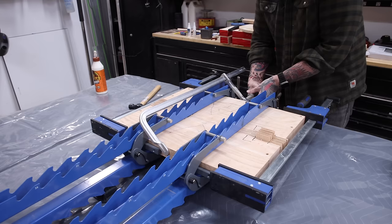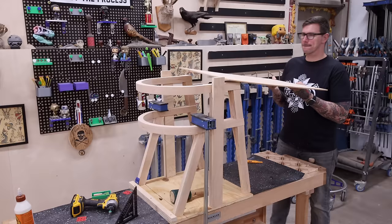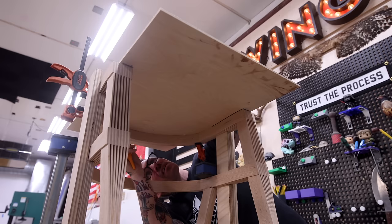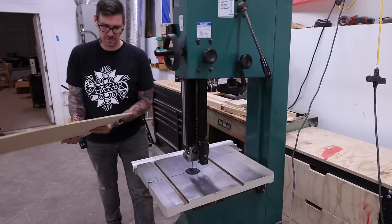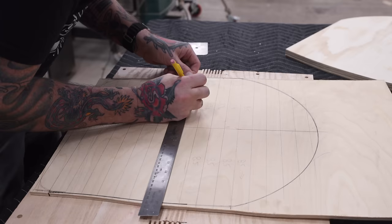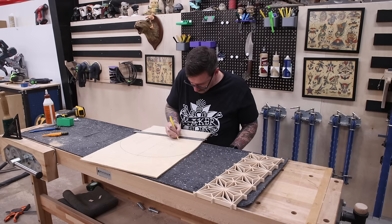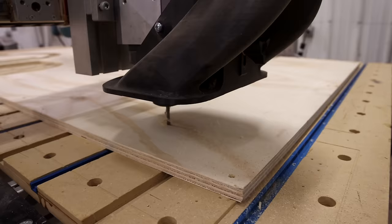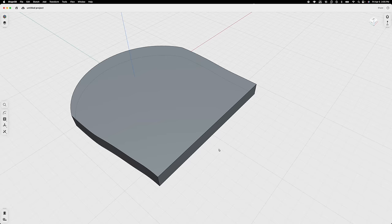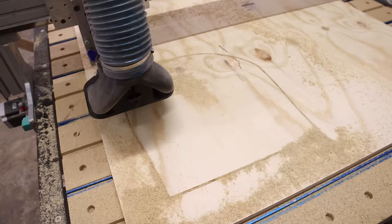With the seat pan all glued up, I have to install it, which is not as easy as it seems. The main reason is where the seat pan interacts with the inward curves of the finger-joint glue-ups — this isn't something I can 3D model beforehand with exact dimensions. You end up with a more organic shape after the glue-ups that isn't perfectly symmetrical. The best solution I could come up with was to make a template by scribing in the exact radius on a quarter-inch piece of plywood scrap, then take those measurements along every inch and import them into my 3D modeling software. Using the fit-point spline tool, I connect the dots and use this to make the G-code to cut it out on the CNC.